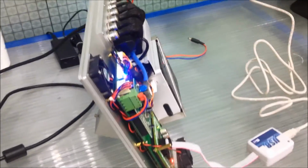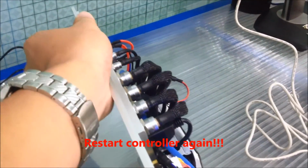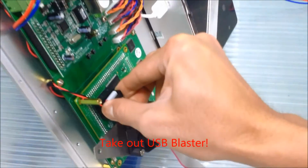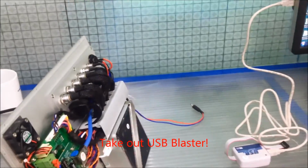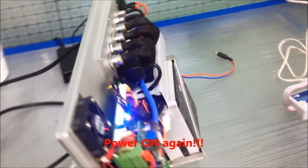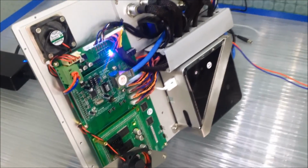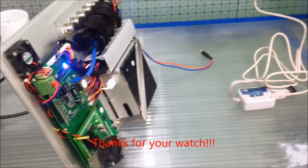Next step, you need to restart the controller by turning off the controller, and then taking out the cable for the USB Blaster. Okay, that is done. Now try to power on the controller. Okay, so you get it to appear. That means the firmware loading is successful. Okay, thanks for watching.